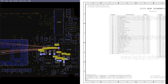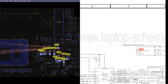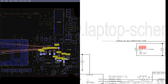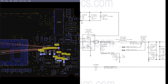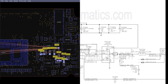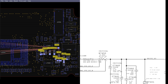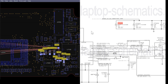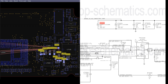Let's see what this capacitor is for. This is C7430 — a cap that sits between PPBus S5HS computing iSense and ground. This is used to smooth out that 8.5-volt rail before this transistor in this buck converter circuit makes PP1V2S3. PP1V2S3 is a 1.2-volt power line, created by this transistor and this chip switching. So here we have 8 volts.